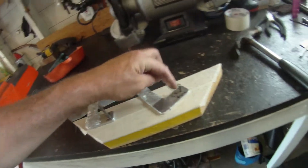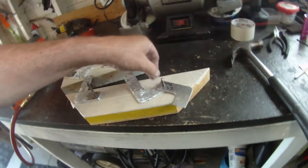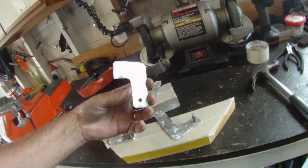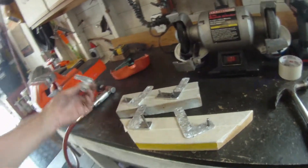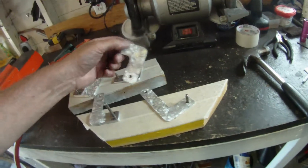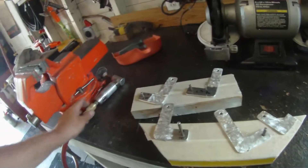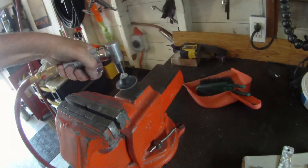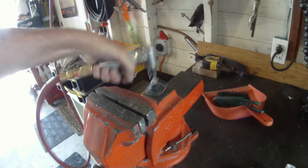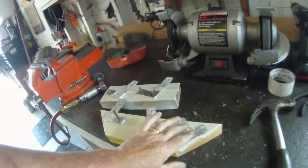I made a little glue fixture, a little quarter inch pin to hold where the pieces are going to be bolted together. You got to rough up the surface. Because if you just take the grinder and run over it, you're not really making it rough enough. So what we did is we literally went like this, just like that, and it makes it gnarly. It actually feels like sandpaper, and it's going to give it a good bite.